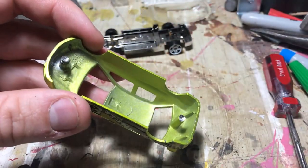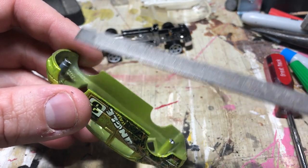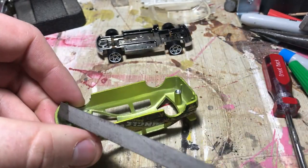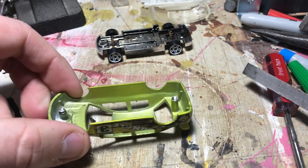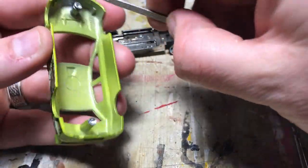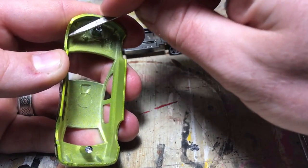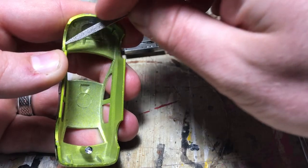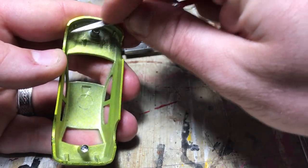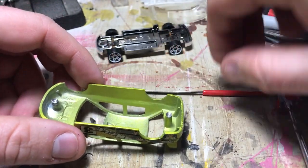On some of these posts, you'll need to file them down a little bit — you can see how this one has a bit of metal around it. We can clean that up. I do that because it makes it a lot easier when you're putting the screws in later so it won't catch. I think that's actually why this one was hanging up. Just take a little file and knock that down — it's relatively soft metal, not difficult to file at all. You can see how that lip is gone now, so it would be a lot easier to get the thing apart.